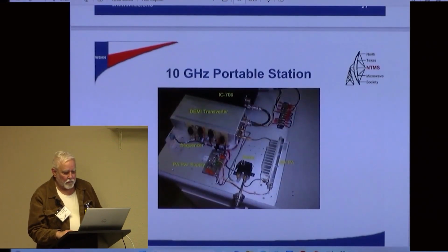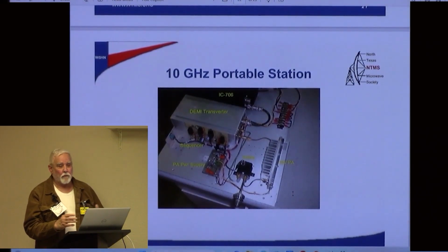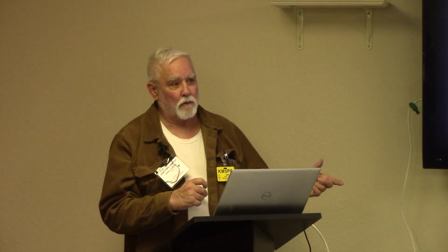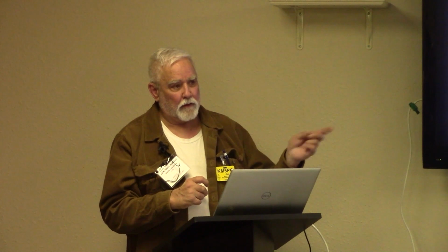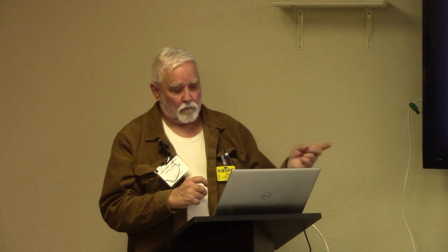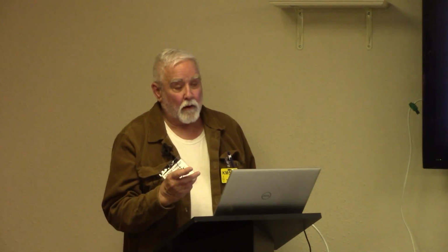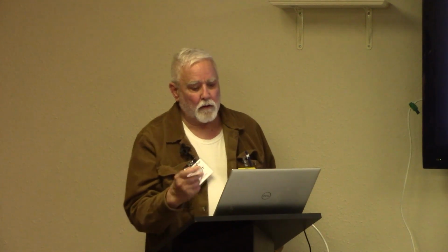And then he put the station together here. So there's the Demi transverter that I passed around, a sequencer below that. Sequencer will control the sequence of events that need to take place when you hit push to talk. So, for instance, you don't want to transmit your IF signal into your transverter until it has switched into transmit mode and the relay that controls the antenna has switched over to take transmit from the transverter. So a sequencer is important however you end up with it. I make my own, but this is a Demi one right here, and there are many available.